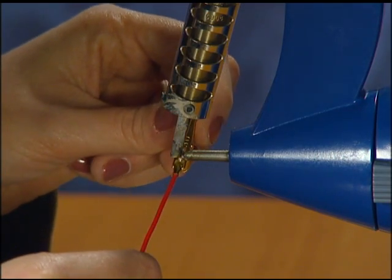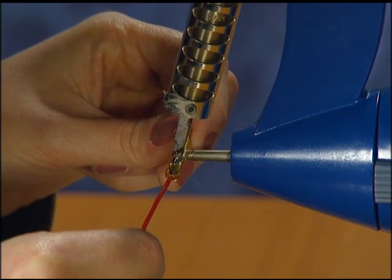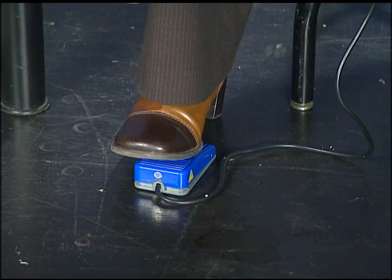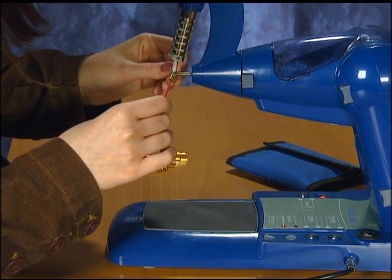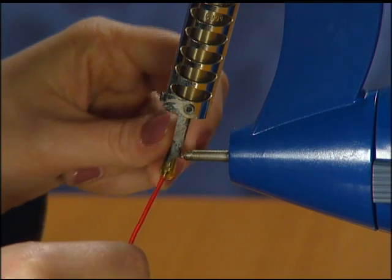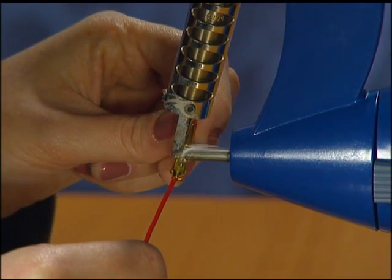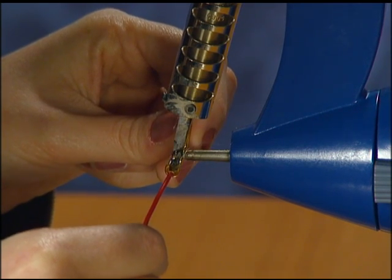The solder feeder tube projects horizontally toward the vertical heated tip. The operator advances the solder with an electronically controlled foot pedal, freeing the operator's hands to place the parts in a position to receive the solder. The solder makes contact with the heated tip for a controlled time interval in a precise position, creating a consistent solder joint.